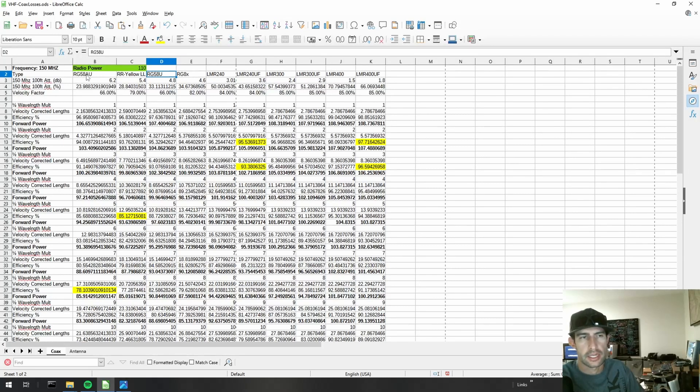This stuff is really lossy. You can equate it to this: if you have 100 gallons of water going through a hose, you expect 100 gallons out the other side — but if that hose has a bunch of holes in it, not all that water is going to make it. That is coax in general, but RG-58 and lower-grade coax cables have more ability to let stray signal escape before it reaches the antenna, so they lose efficiency drastically.